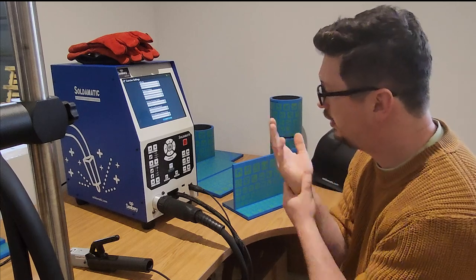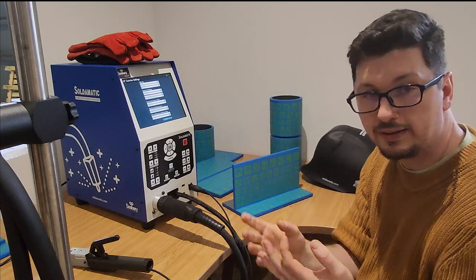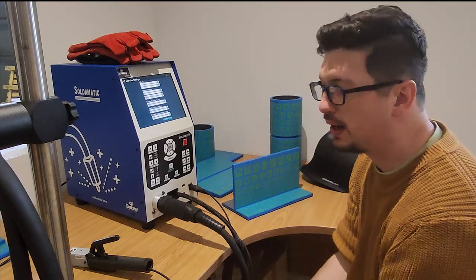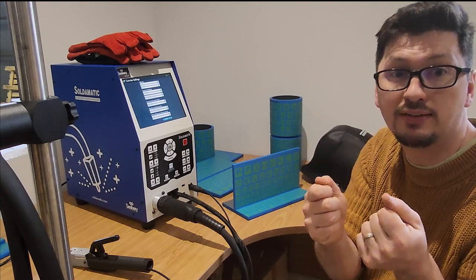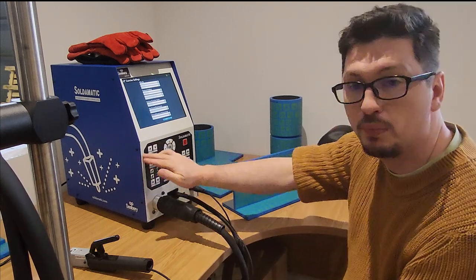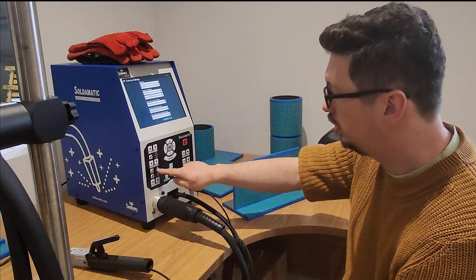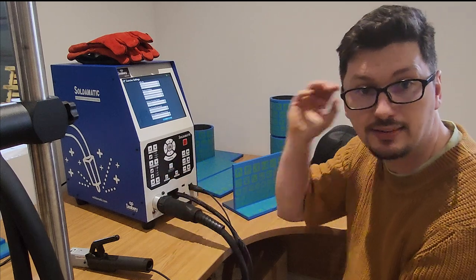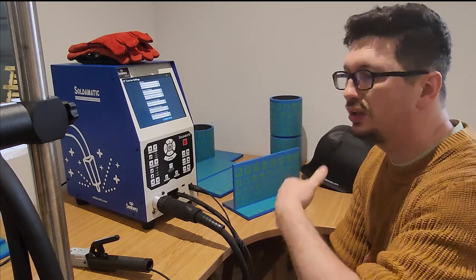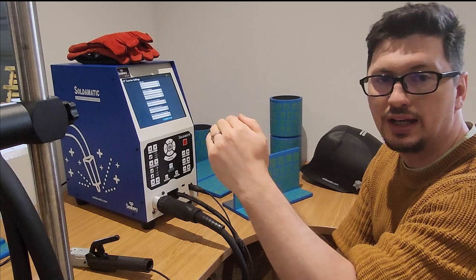We can have the set either require me to input welding variables such as amps and volts or wire feed speed, but also we can just say, look, just start up with the correct values. So that's what it's currently on at the minute, so we don't have to mess about. But what I can do here is actually produce a WPS, give the student a WPS and say, well, for exercise one, set these values, and using the inputs on the machine here for my voltage, my AC, DC positive, DC negative, my amperage, and my wire feed and the gas levels, they can be set. Now, if they don't set them correctly, you'll get porosity and stuff in the simulation, but you'll also get a cross against the output when we come to analyze the data, because it will say, yes, you welded okay, but your settings were wrong.